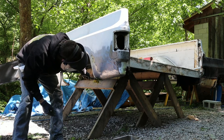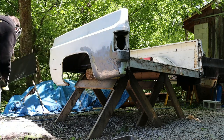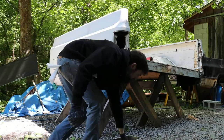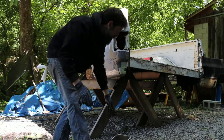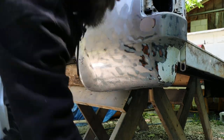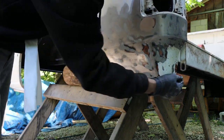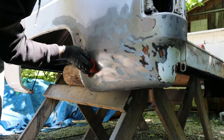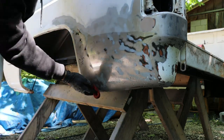I've been wiping this going on probably three, maybe four minutes — less than five minutes for sure — and we've almost got it all gone. Now you can see my water is a bit rusty colored because I've been doing this a little bit. We're going to wipe this down and neutralize that acid. We want to stop that acid from working so it doesn't continue to eat away. This baking soda and water does an excellent job. And then, to keep it from flash rusting, we need to make sure that it's dried as fast as possible.